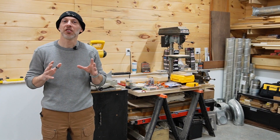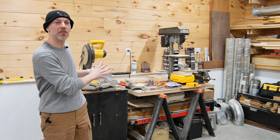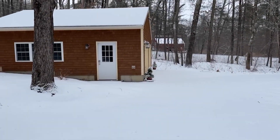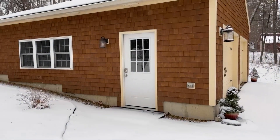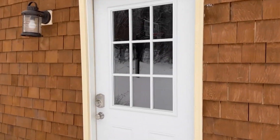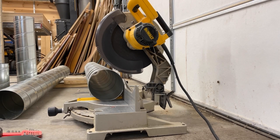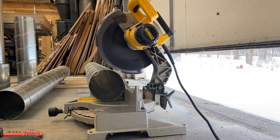The last thing we have to do is run the ducting from the main line to the table saw, but in order to do that we first have to get rid of all the stuff on this wall. With the area cleaned we can start to cut the ducts to length. I normally do this kind of metal work outside, but as New England decided to greet me with a bit of winter this morning and with more precipitation on the way, I set up inside the garage. I swapped my saw blade for a grinding wheel and started to make cuts, and since this produces a ton of sparks and nasty fumes I opened my garage door a bit and had a fan going to blow the fumes outside.